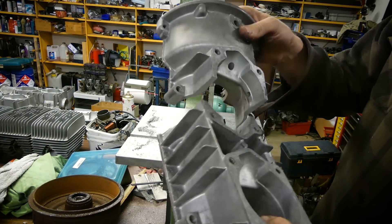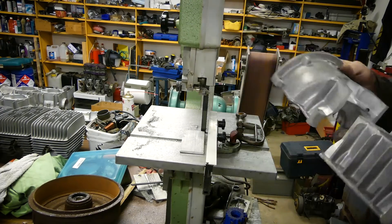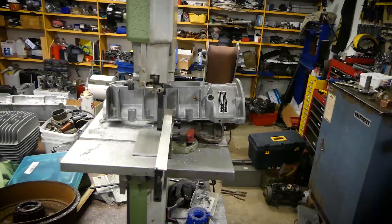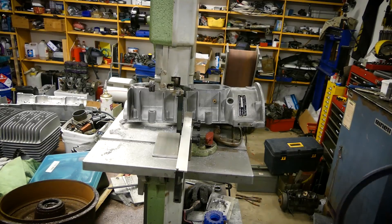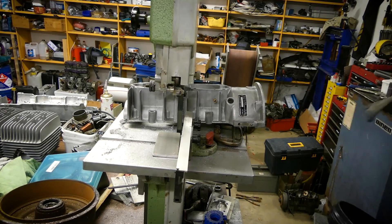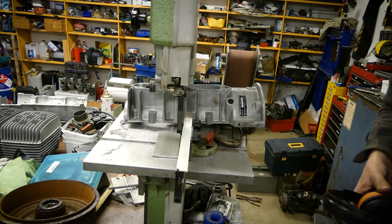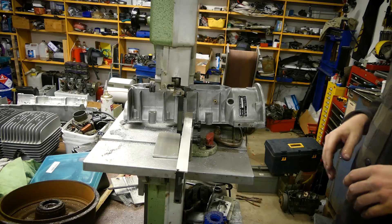That's one part. I guess there's really no going back now. I'm not using any cutting oil because I want to keep it as clean as possible - these cuts are exactly where I'm going to be welding, so I don't want to fill it with oil.